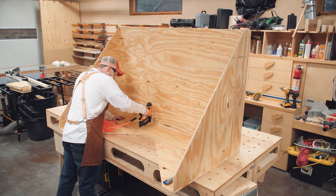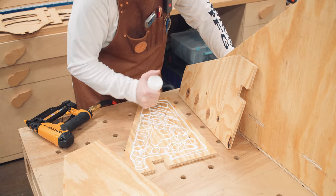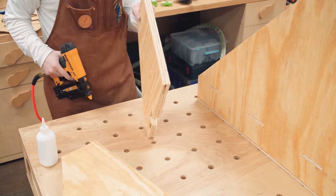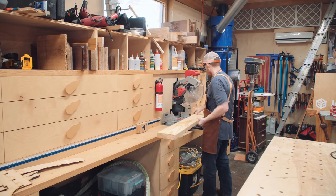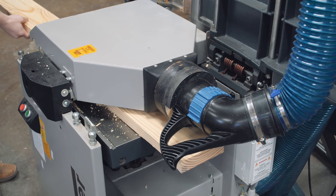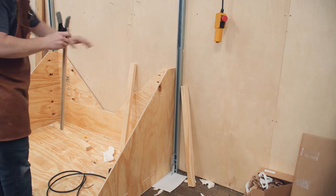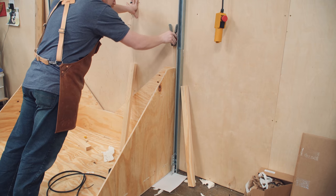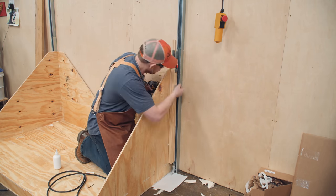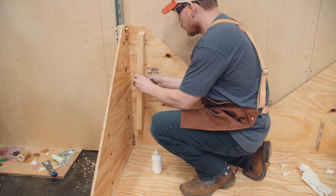The last piece of the platform assembly is a wide rectangle that goes across the lower back panel, and this is to further strengthen the back panel right where the lifting strap will be. The last step for that day was to create the brackets for mounting the horizontal super strut upstairs — four brackets with a total of two pieces of plywood each. After that, I let everything sit over the weekend for the glue to fully cure. Back in the shop on a Monday, the work starts by breaking down some solid wood boards. Wood pricing is pretty crazy at the time of making this lift — it was actually less expensive to buy southern yellow pine 2x6 boards than it was to buy white pine 2x4 boards. These pieces are for added support for mounting the trolley blocks. My SketchUp design called for a one-half inch spacing away from the wall, so a spacer block was slid into place and the lift pushed up against it. Then the outside solid wood piece is attached with a lot of glue and a few wood screws from the inside. Then some half-inch holes were drilled and the trolley blocks were attached with a few half-inch bolts.